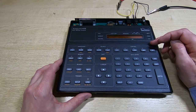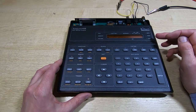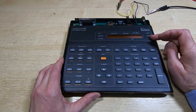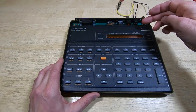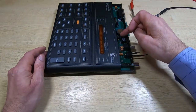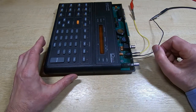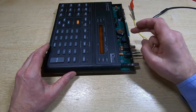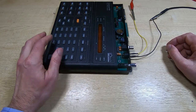When you turn the main power off it switches over to the backup battery. It also has a circuit inside to control the chip select line of the SRAM, because if you let the power drop completely on the entire board - including the chip select line - then not only will the main power go down but you'll also lower the write enable line and the chip select line, and that will cause spurious writes to the RAM chip. The controller chip pulls the chip select line high as soon as it sees the main power starting to drop. I buzzed it out and there weren't any connections from this to the RAM that I thought was battery-backed, which is the one that had failed.